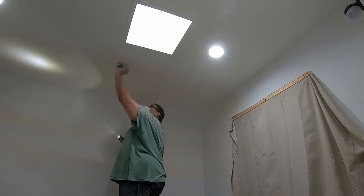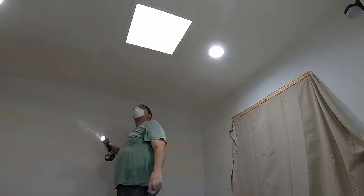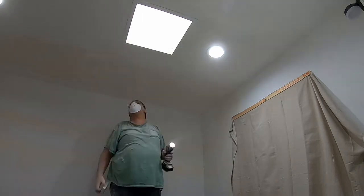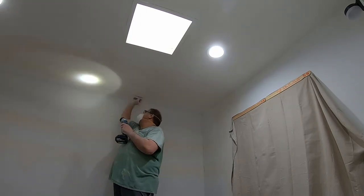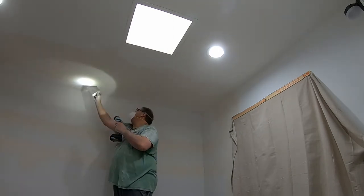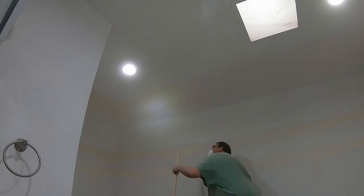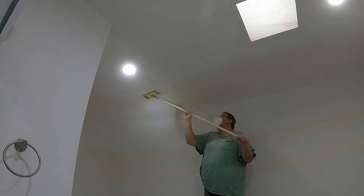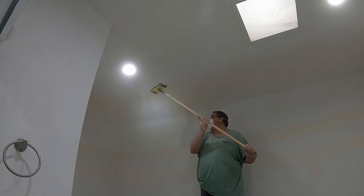I'm using the light here to create shadows from the imperfections in the wall. If I plan on doing a lot of drywall work in the future once I get my construction company open, I'll buy a nice light system that can go on a stand so I don't have to hold this thing. As a little test: stand five feet away from the wall and point a bright light straight at the wall — it's going to look fine. Then take that same light and hold it about five degrees from the edge, pointing it down the long way of the wall, and you will see all sorts of waves and imperfections that the original contractors missed.